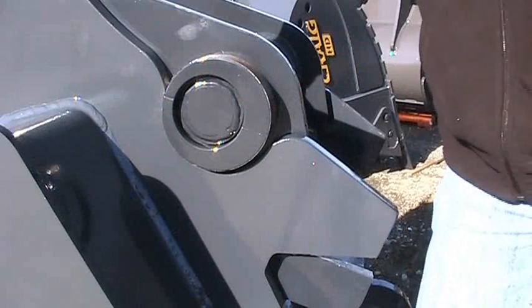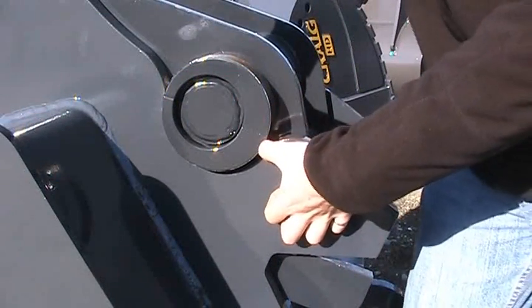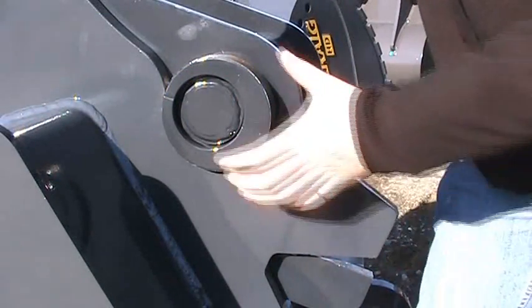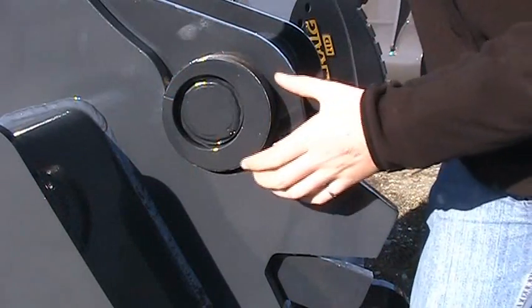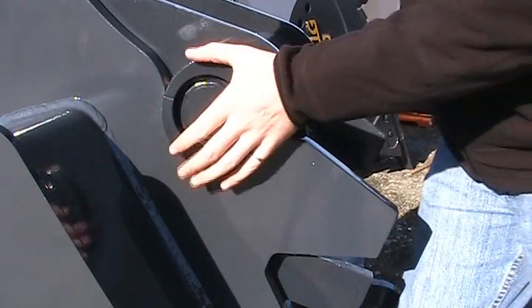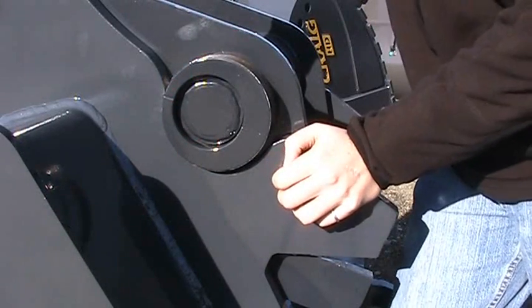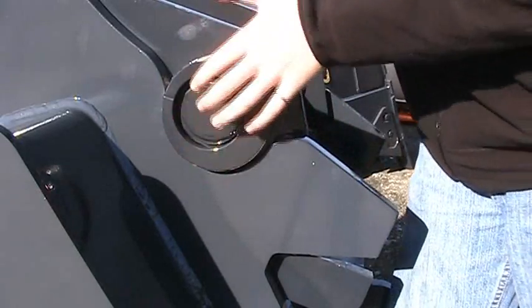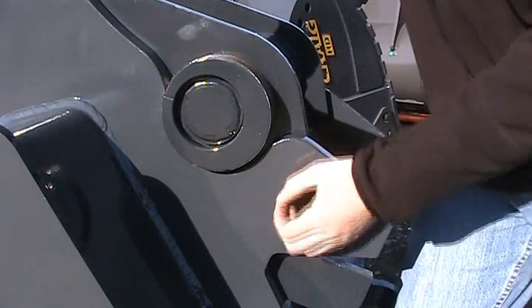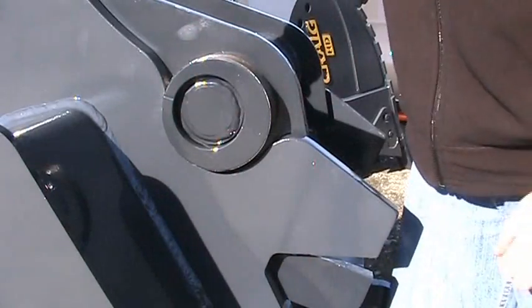On this middle boss you're going to notice that there's an intentional gap on the back side of it. We put this boss off to the front in order to maintain a tight fit from when the coupler is new and as it wears. As the coupler wears, this boss will settle and remain tight against the front side of the saddle.